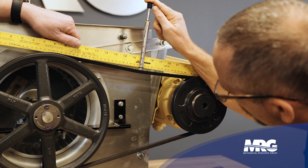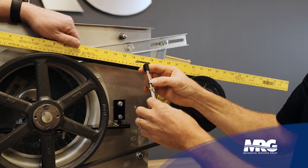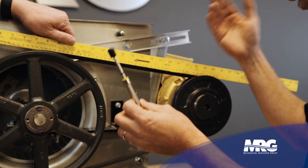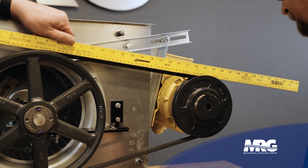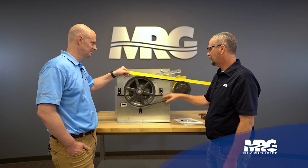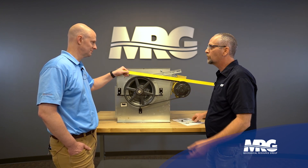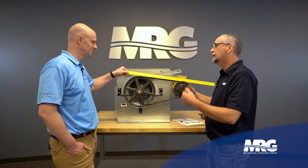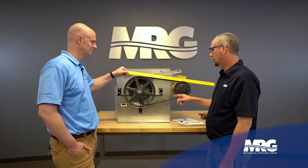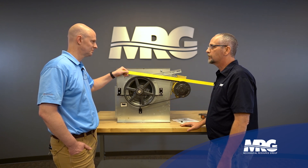That to me is right there at the bottom. Looks like we're sitting right at about eight pounds of pressure — so we're right on the spot. When I first started doing maintenance, I would have thought that belt was way too tight because I wasn't using this tool. I was going by what everybody would tell me — you get trained a certain way and that's the way you start doing things. I would have thought that belt was way too tight, but in fact it's right there where it needs to be.